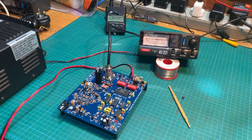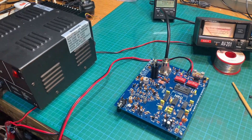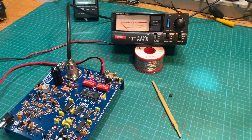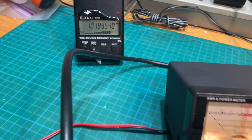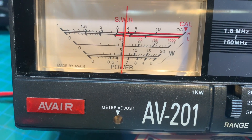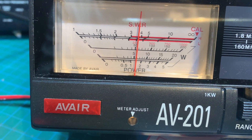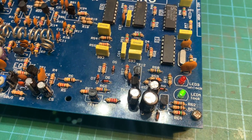So we're all wired up to the power meter now. Frequency counter's running — switch it on. We're going for a green LED, and then we should see our power go up on the meter. There we are — got our frequency, pretty much 102. Looking at the 5-watt scale, we're at the very bottom — about a watt and a half. That's not bad at all. And we're locked on frequency. Perfect.